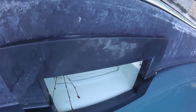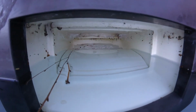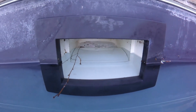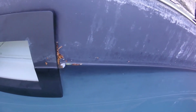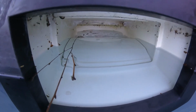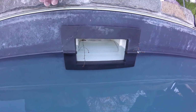So as the stuff goes by, the leaves and things like that, the weir causes that action, and using the tension on the water, it draws the stuff into the skimmer. But the skimmer needs to be cleared out and maintained, so the stick needs to come out. Need to get rid of the dead mouse. And let's see, here's something else coming floating along here. Watch it. It's going to go right into the skimmer. So without the weir, that doesn't happen. It just floats right on by. So that's part of the process, keeping the pool clear and clean.